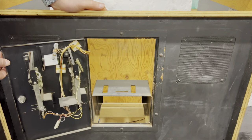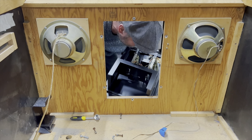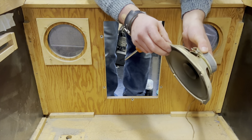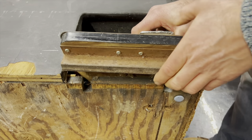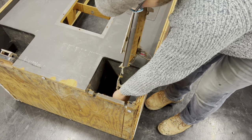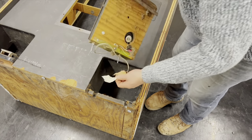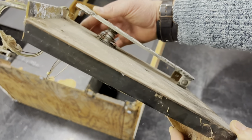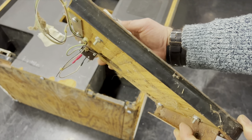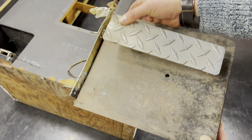In part one we removed the monitor and the PCB, which now gives us good access to dismantle the rest of the internals — the coin door, speakers, and the pedals. We're going to return to them later in the video because the plan is to give them a good clean, sand them down, and re-spray them. With the internals removed, it's interesting to see how the pedal works with a simple spring connected to a microswitch that gives you restriction and feedback for the acceleration in the game.